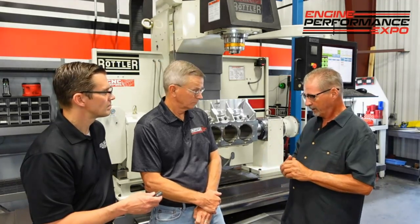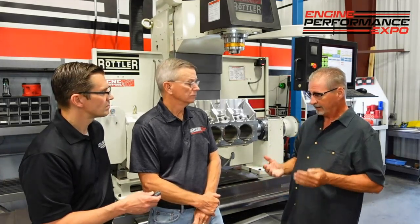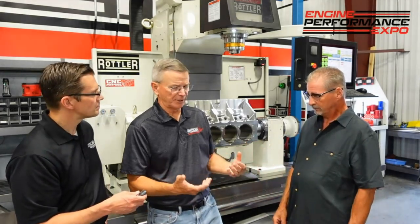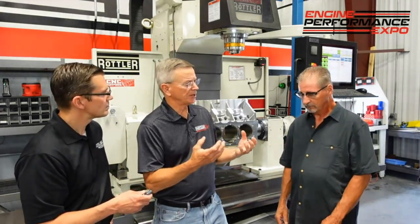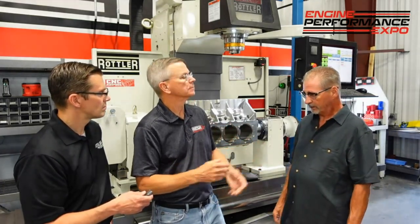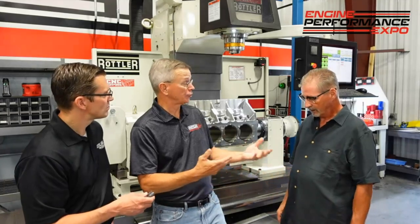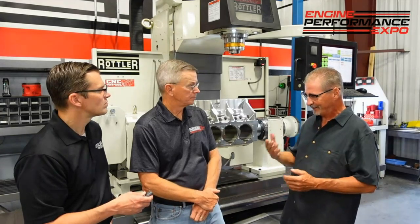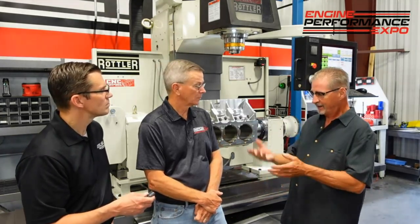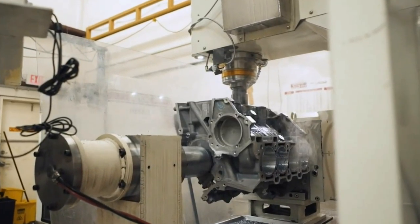You've got to put that insert to work. Find that value, use those recommended speeds and feeds, start there, then work your way forward and backwards until you get the optimum for the machine. Does the chip actually help pull heat from the insert? Yes, it does. So another reason to make sure you have enough chip load. Your infeed comes in too — make sure that infeed continues to the next cut. That chip pulls heat away and then lets you go.